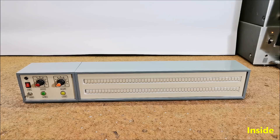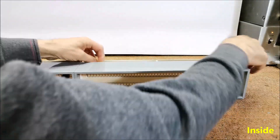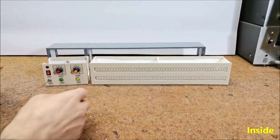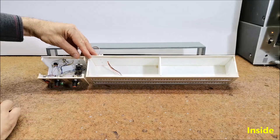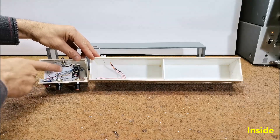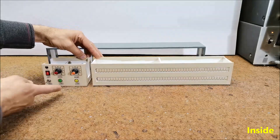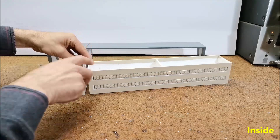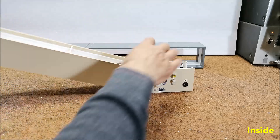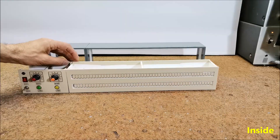The device is relatively simple to make and contains only a few components: an Arduino Nano microcontroller board, five 10K ohm resistors, two 10K ohm potentiometers, two buttons, one switch, audio input jacks, and a WS2812B LED strip with 50 LEDs per channel, totaling 100 LEDs.